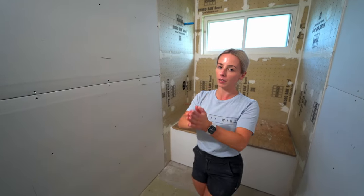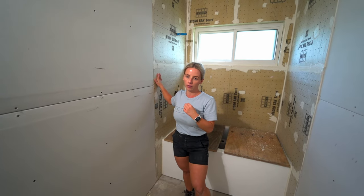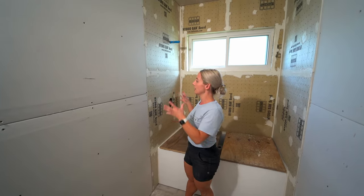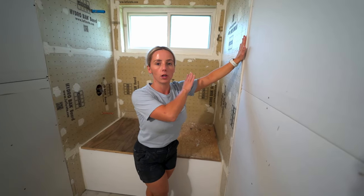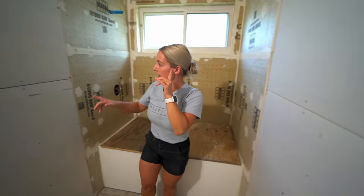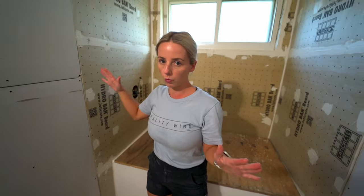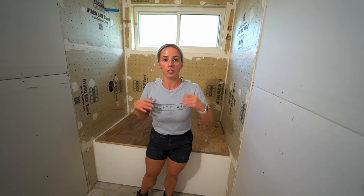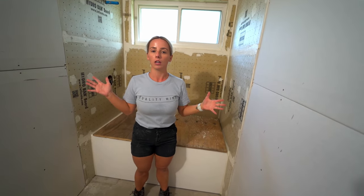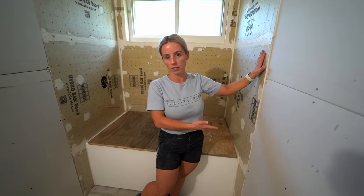The method we used to get our drywall flush with the wall board inside our shower was adding another layer of drywall. We were able to do that because of the difference in height. Sometimes you might end up with a difference that's not quite half an inch — they do make drywall in smaller thicknesses — but for this side we're going to float it out with drywall mud. The other side came out perfect; the drywall and wall board are pretty much flush. The biggest thing is that you want to get your walls inside your shower flat and plumb — that's what causes this problem in a lot of cases.